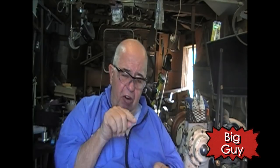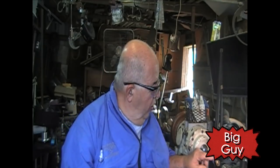But when you want to get a fantastic shine, or the chatoyance, the natural beauty of the wood to come out, for the light to go in and for the light to come out, it's pretty simple. You have to have the scratches gone. So if I sanded with 80 grit paper and then stepped up to 220 because it looked pretty good, I left a lot of scratches from the 80 to the 220. There's this area in there that I did not knock down. It's still in there, it's ridges. It's like if you took a rake and tried to level out the desert, there'd be ridges where your feet marks are, right? Okay.